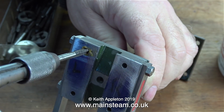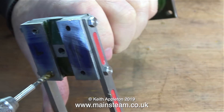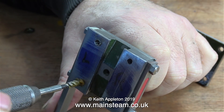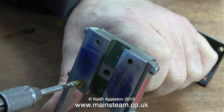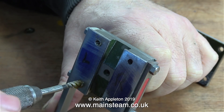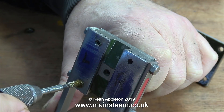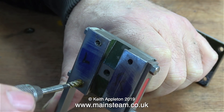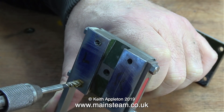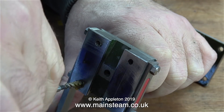So why am I doing it this way? Why not just drill the holes in the steel plates clearance size for the tap? The reason for doing it this way is for the tutorial, to show an alternative method rather than just drilling and plugging the top of the column. I was very concerned that the tap would wander when threading the hole in the top of the cast iron, as it's been plugged a couple of times. By mounting these plates on top of the column, once the tap goes through the plate perfectly at 90 degrees, the hole should follow suit underneath. The threaded hole in the steel plates will act as a really accurate guide to make sure the tap stays where it's supposed to be.